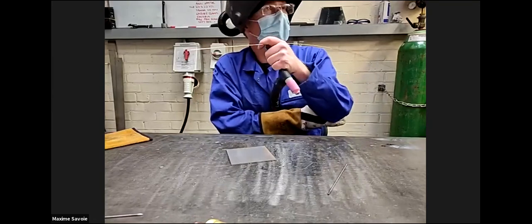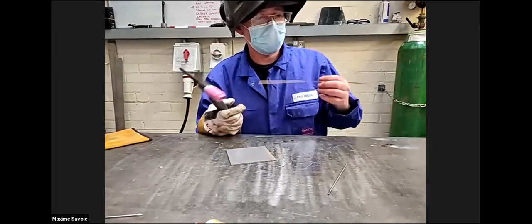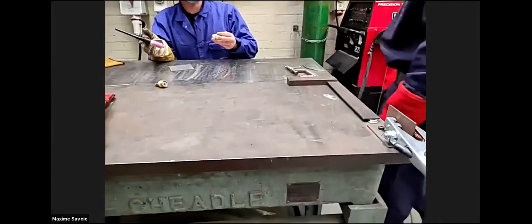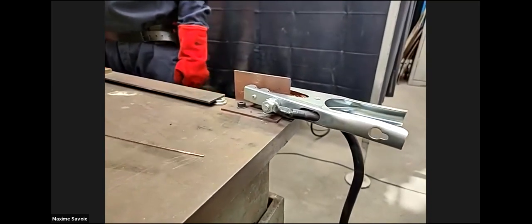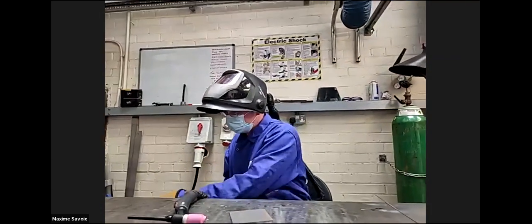Ultimately, that will short circuit it out, so we've got the return earth on the corner of the bench there. If, for example, you're not wearing any gloves and you were to do that and you touch that, you would become the return earth and you would get an electric shock. So that's another good reason why you should wear gloves. That's the return earth that makes the circuit. Once you depress the pedal on the floor, that makes a full complete circuit.